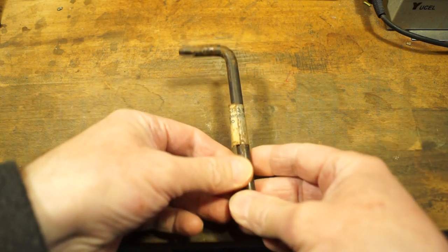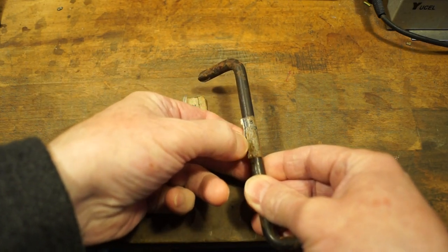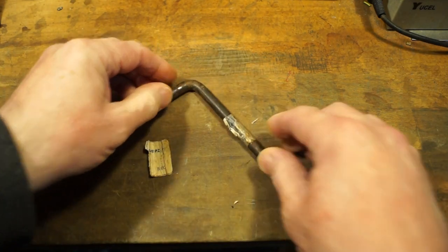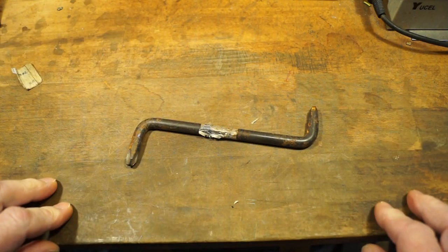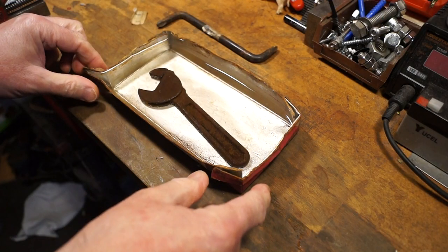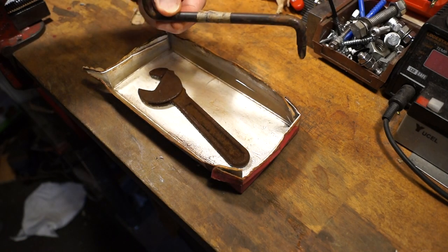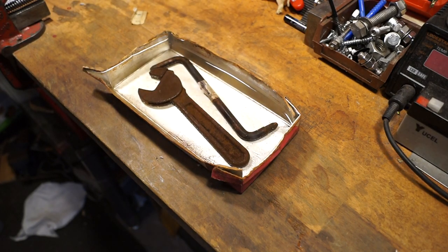So I thought what I'll do is I'll do a very quick clean up on this little fellow. The first thing we'll do is get the label off of it. That came off rather easy-ish. I'm going to stick it in a little tub of vinegar — a little bath of vinegar — and see if we can soak the rust off. I already have another project in a vinegar bath, so I'm going to pop the proto-cranked screwdriver in there right next to it and we'll leave that overnight and see what it's like tomorrow morning.